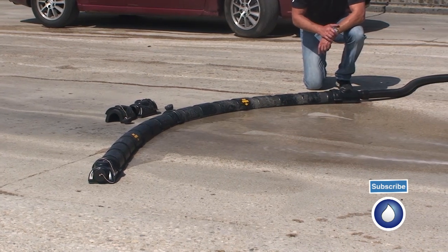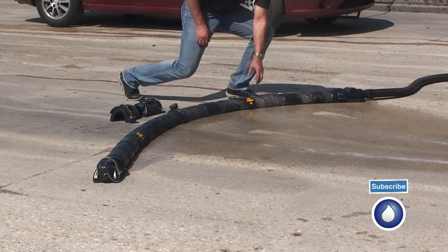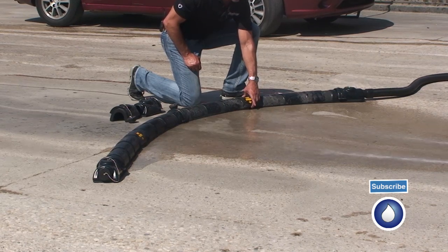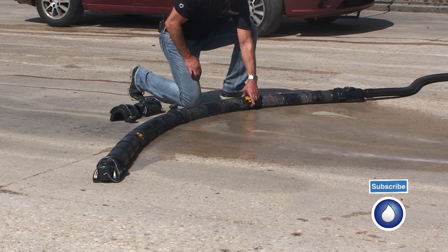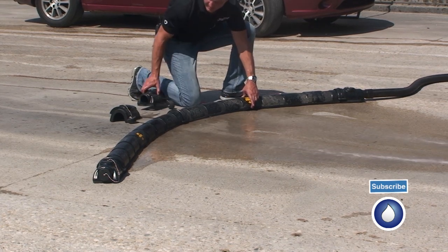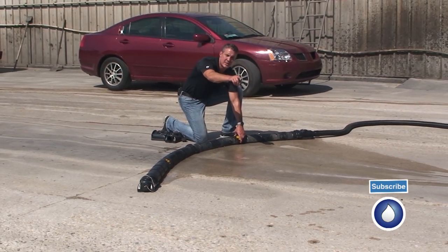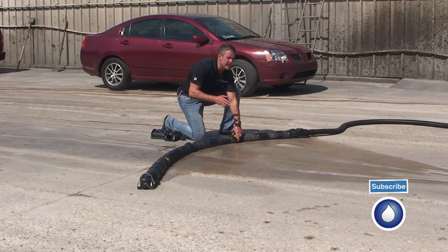That's 10 gallons a minute going into this. And it's going to run out the other side now. So if I were to take a screwdriver, kind of lift this up like I'm doing with my fingers, that way it can handle that flow. Sometimes you have to adjust it. You can hear the system working because it's pulling so much water through now. And it's pumping off. So it's discharging at the same time we're recovering here. So that's 10 gallons a minute.